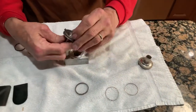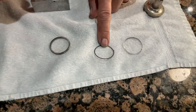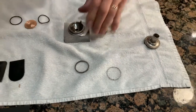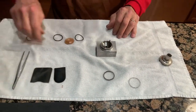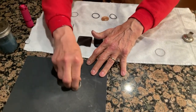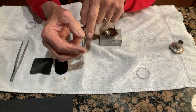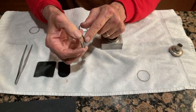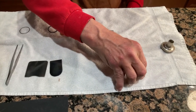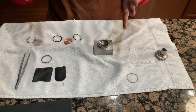You also need to look for rust. The retaining ring here has rust; this other one I've cleaned up better and doesn't have as much. First, take some 600-grit sandpaper, take the retaining ring, and just gently sand it — that will flatten it out a little, because they used a cut-off blade when making these and they might be slightly warped. It needs to seat down on the metal washer we're going to put in, which helps squish the rubber gasket together — without it, the gasket peels out.